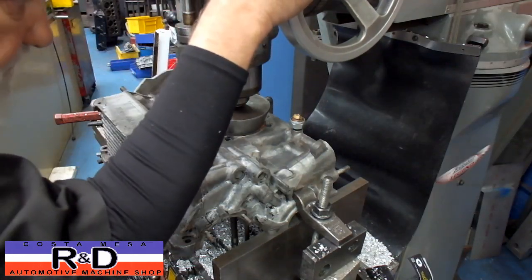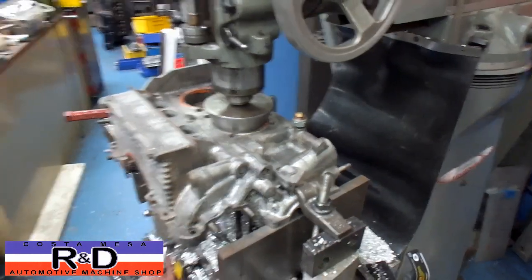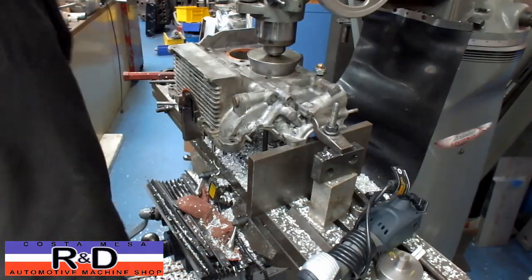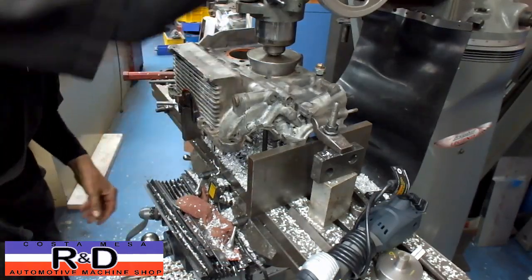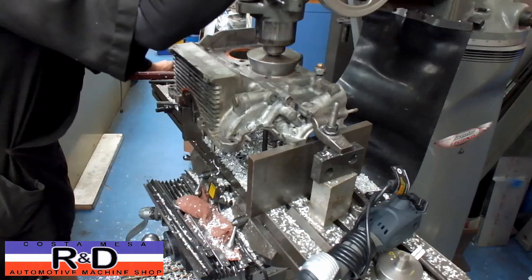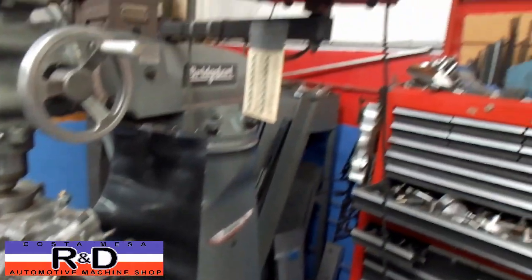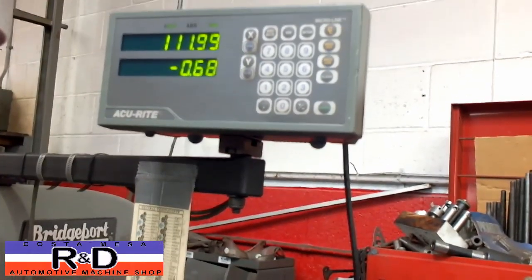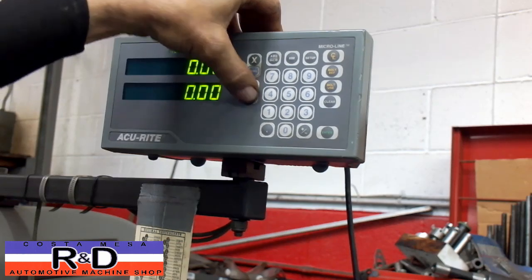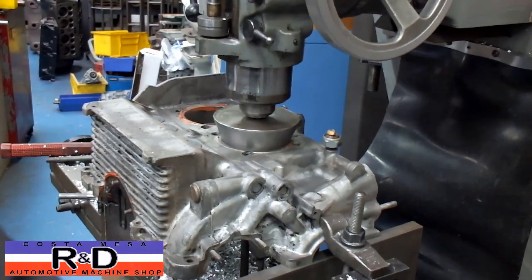Put the pressure on the handle. I'm holding down on the handle and we're jiggling our handle until the table doesn't move. I'm going to do the same thing on the x-axis. That looks good. We're going to take and zero out our x and our y. Now that we have our starting point at zero, we can go ahead and do the other side.